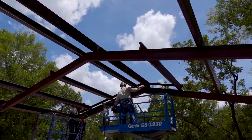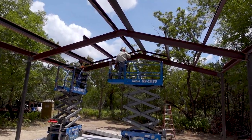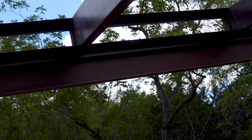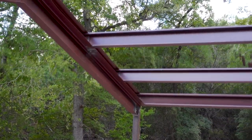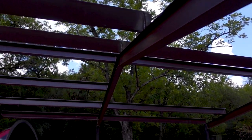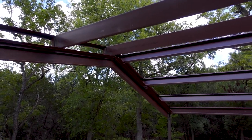As you can see, these guys are moving right along. You have the base angle up here — that's for the roof sheets and the wall sheets. Then on the underside, right here, you have another base angle. That's gonna be for the metal soffits to attach to and the skirting. So now we gotta do another one over here so we can put the metal soffits under here — they're gonna attach that to that base angle.